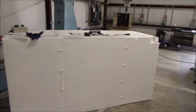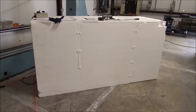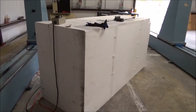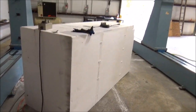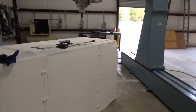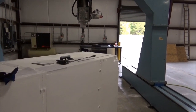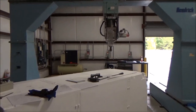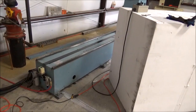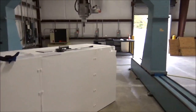Here's one of these billets of foam — you can see it's eight foot long, 49 inches high the way it's sitting, and 37 inches wide. We were basically just messing on one of the corners with it right now, doing some tests and calibrating the machine in all the different axes. Obviously there are five different axes to calibrate, and we've pretty much got that done — calibration is done. So I'll be anchoring it down, hopefully today or Monday we'll have it finished anchored, if I can get all these holes drilled. We already know how to run it and we've run some programs.